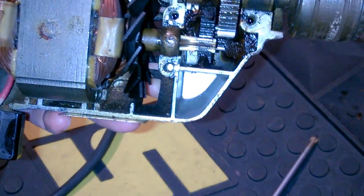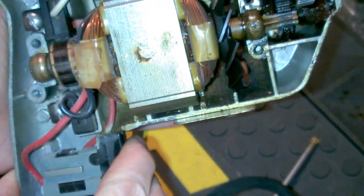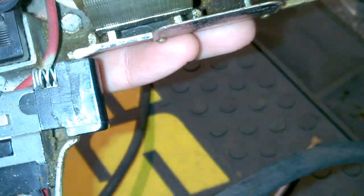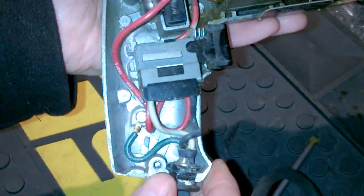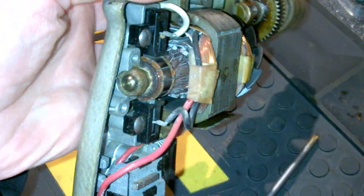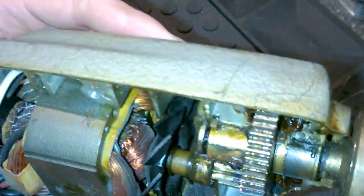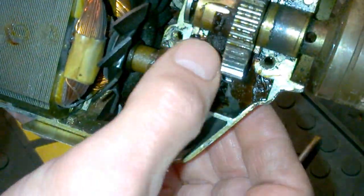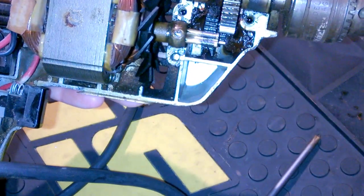Not atypical for this kind of design — I did a previous teardown where a similar design was in effect. The trigger has a nice solid click, which is good. Brushes look okay, looks like they've got about half their material still in there. Wiring is good, the green ground wire is properly connected to the case — always important. Strain relief on the wiring looks good, rotor looks nice. All in all pretty clean. There's also a brass bushing in the back where the rotor connects to the rear of the housing. The windings look good, a little dusty but not bad. Grease is a little tired — we'll change that out.